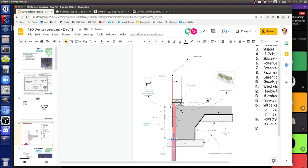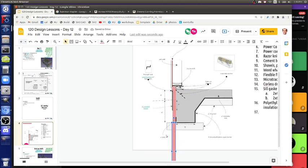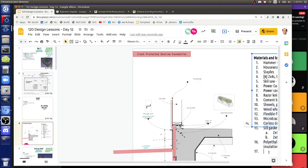In Missouri, you have to go down 3 feet. So we could have done that, a lot of heavy digging, or we could do this: no digging, because we're effectively at this level right now, around the foundation is about there. At the end, it's going to look like this, actually. It's not quite there, because that goes a little deeper. When we do this, we still try to slope it, and you'll see on the foundation it slopes down a little bit. So we could add levels to our materials.